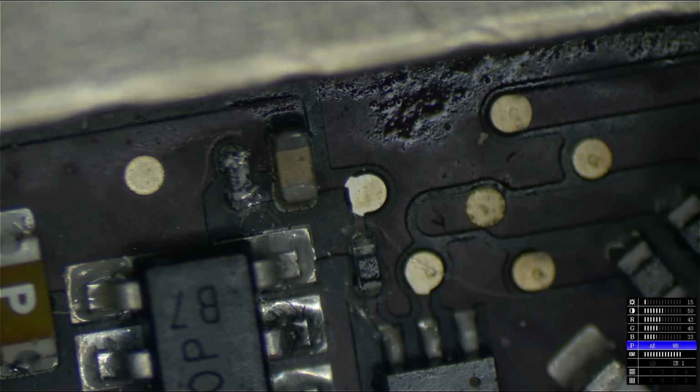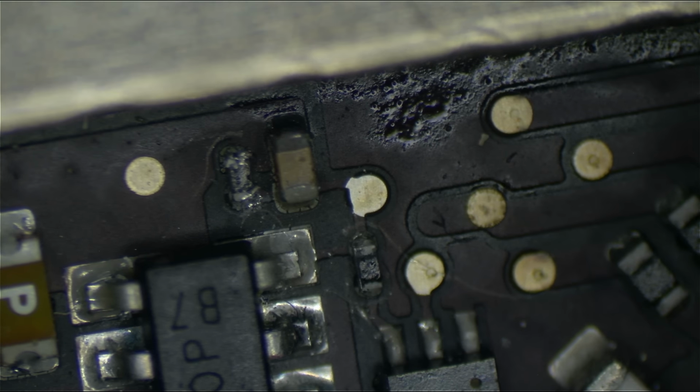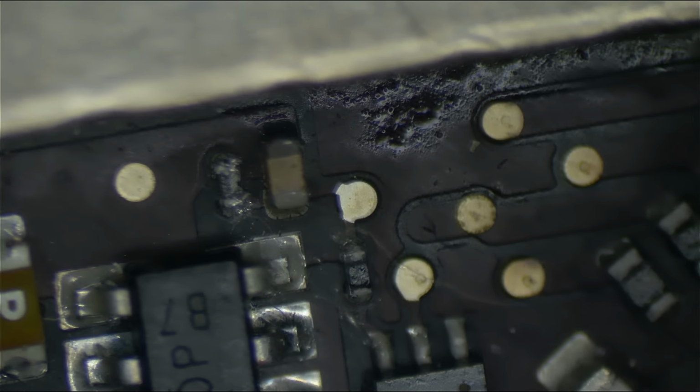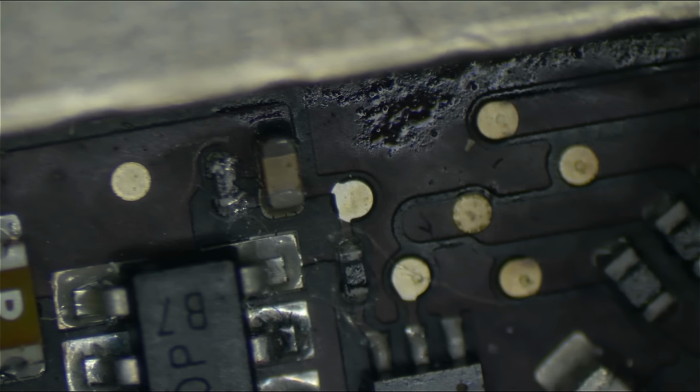And again, you think I'm going to buy those resistors from Mouser and wait a week or two for them to come for me to put this machine in the window? Hell no. I am going to take them off of a donor board because we don't have time for that nonsense. So the best source of any of these parts is to buy a bunch of dead boards with the holes in them off of Alibaba and then use those to take parts as needed. I'm going to replace both ends of the voltage divider just for the hell of it.